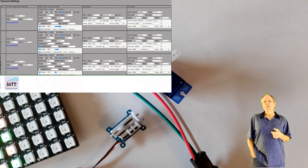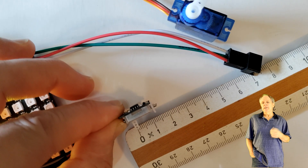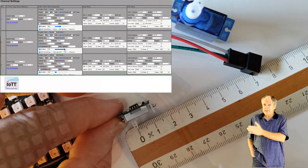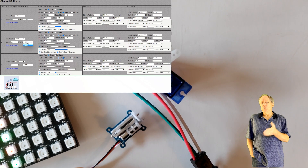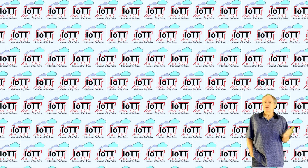I then opened the green hat setup screen to set the boundaries of the movement. I carefully increased and decreased the maximum and minimum values until the servo started to stall towards the end of the movement. The maximum usable travel distance turned out to be about 8 millimeters, slightly more than indicated in the datasheet. On the negative side, if the servo runs into a mechanical stop, it will not break loose when starting the move in the other direction — I had to manually turn the gears to get it going again. This is not good design, and a careful setup with some reserve for overshooting is recommended. If the servo stalls somewhere on the layout, you may have problems accessing it, which could be a real showstopper for your operating session.